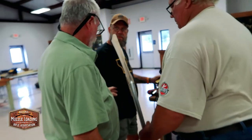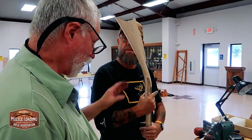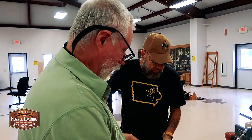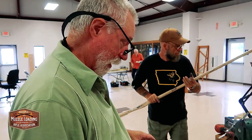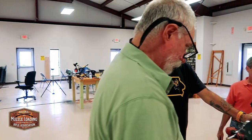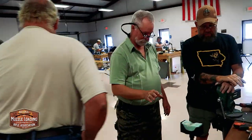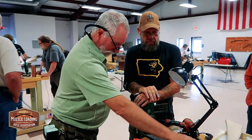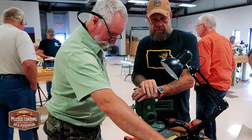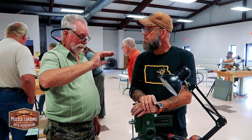Sandy's theory — what sanding is really all about — it's not about wood removal. It's about taking out tool marks. You get that all sanded out with 220, and you can even start whiskering them with the 220. All you're going to do is take out tool marks — chatter marks, tooling marks, rough spots. You're not going to remove wood; that's not really the purpose of sanding. You're going to want to stay away from this edge here. Come up to it, but don't lower that edge, because on your tree it's going to stand out real proud above the wood. You don't want that.